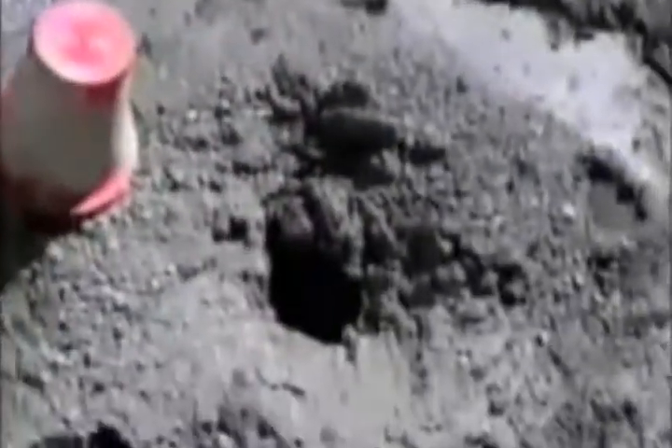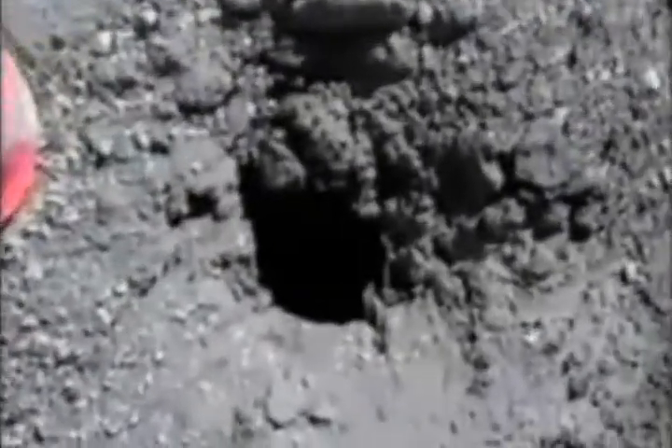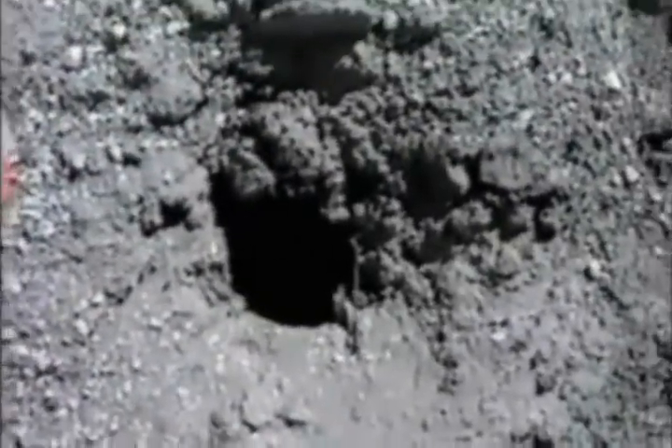One of the questions that Wyatt asked me was how it was going to do in water, and these holes are all drilled in a saturated area of the pit that's got ground water standing in the holes at about 10 feet. You can see the nice, neat collar — the hole is a real precise diameter, six and three-quarter inches down through the sub drill, a place where they've always had problems here before.